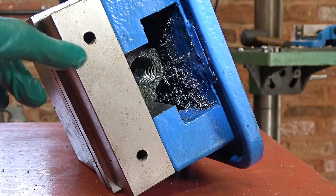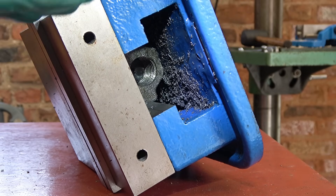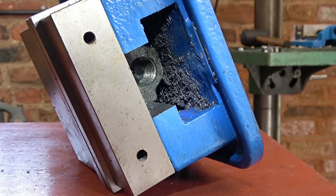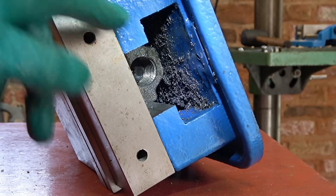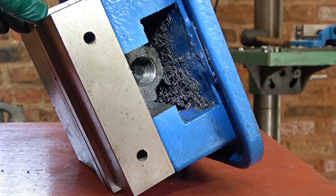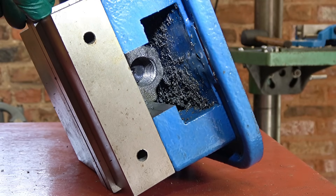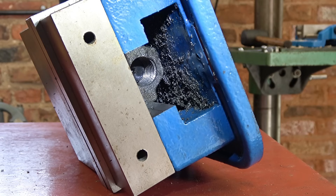I should explain the reason that I want to make a new screw. It's not so much that it's a bit of a rough old thread, which indeed it is. It's more that the screw is too short, I think. Now it is quite a long nut, to be fair, but with the jaws clamped, the screw is about 35mm short at the end of the nut. So it's a nice exercise for me to try and cut a new screw.